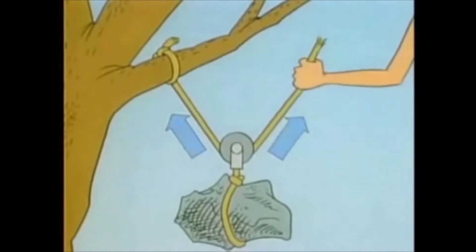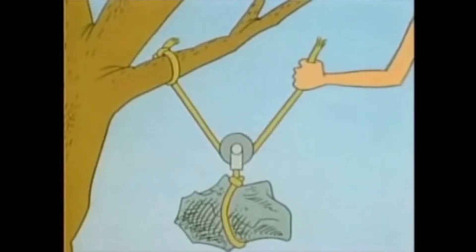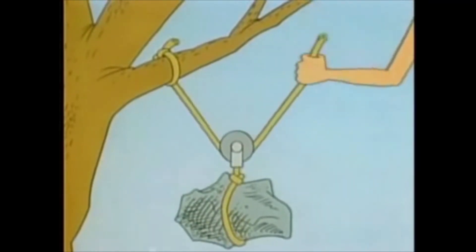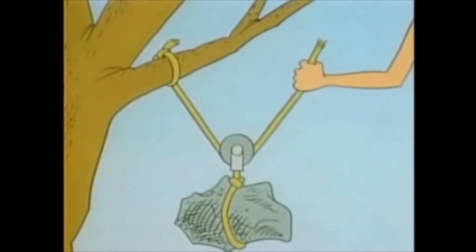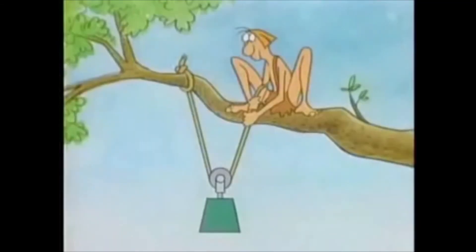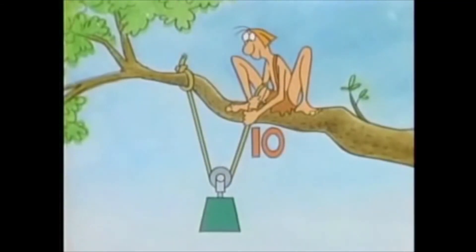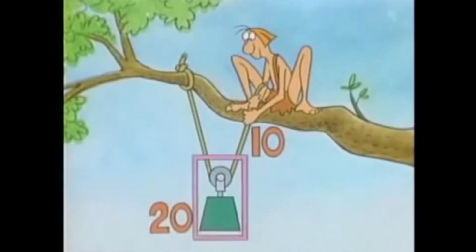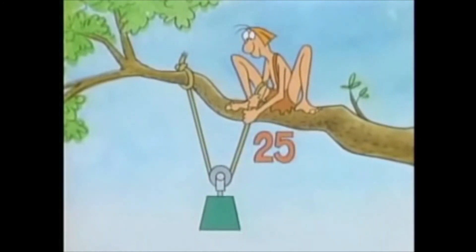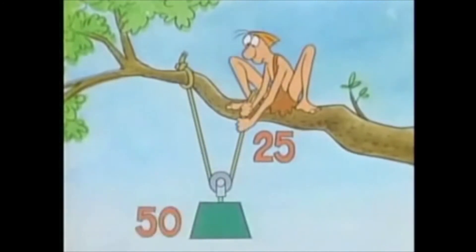Because the rope can roll through the pulley, when you pull up with your half, you raise the whole load. So when you apply a force here, the pulley lifts with twice as much force. With 10 pounds of force, you can lift a load that weighs 20 pounds — though the load includes the weight of the movable pulley itself. With 25 pounds of force, you can lift a load that weighs 50 pounds.